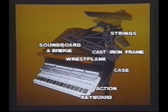A soundboard carries the bridge through which pass the string vibrations. The soundboard amplifies and transmits these vibrations to augment sound waves. The cast iron frame, along with the assistance of the rim, supports about 20 tons of tension from the strings. And finally, we have the high tensile steel strings, different lengths, different sizes, and even a different number of strings in each set to make up the piano's 88 different notes.